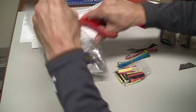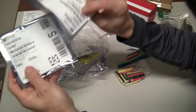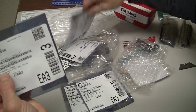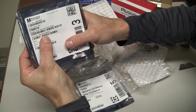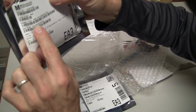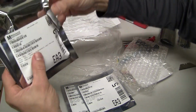Let's just take a quick look through the baggies. Okay, four pieces of the 165 shift register, four pieces of the 595 shift register, and we have the 1.8432 oscillator, the 10 megahertz, the HCS74 flip-flop, and two pieces of the MAX5 CPLD. This one is the 5M160 size of CPLD. It has 160 macro cells of logic in it.